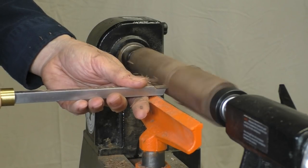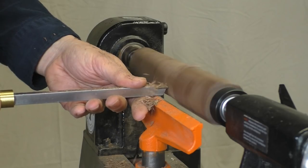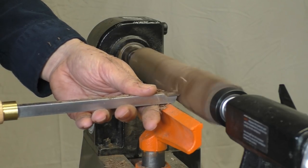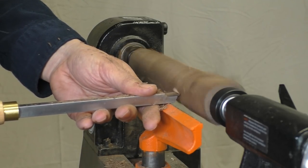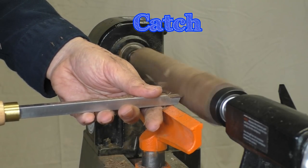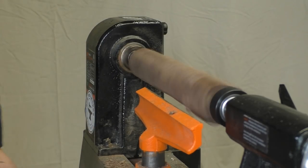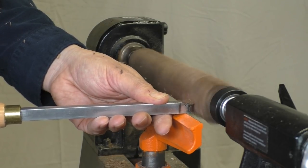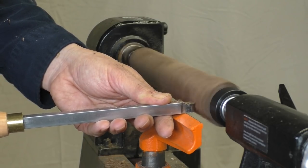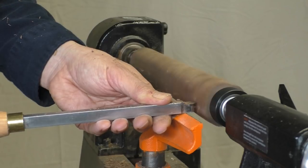When half my piece is round I move the tool rest and start working on the other half. I always make my spindle projects extra long — this one is long enough for two foot massagers. If I make a mistake I'm already set up to make another one. Watch what happens right here — that's called a catch. The tool dug in hard enough to keep the piece from spinning. Catches happen to everyone and generally they're more scary than dangerous, but when I get a catch I try to pay extra attention. I think my tool is a little bit too low so I'll bring the rest up a little bit before I keep turning.